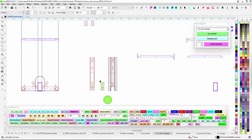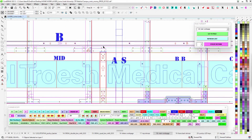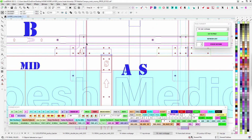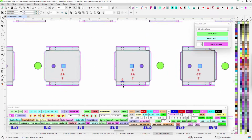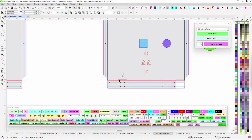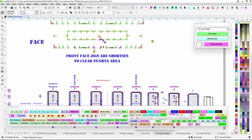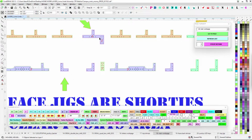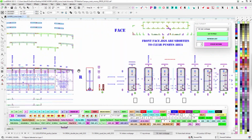This little guy here, like I say, keep an eye out for this splice. This is just to back up and stabilize the seam for the 2 push-through faces at the bottom. So you'll see where this jig on the front is a specialized jig that has a tab that will slide through the slot that you see right here. I have S for seam right through there, and that will jut down and allow you to hook up that piece right there and tack it in place, and that's going to stabilize that seam. So that's the point here.